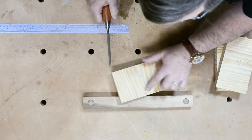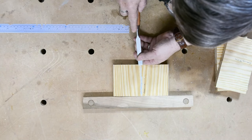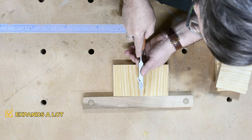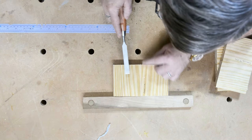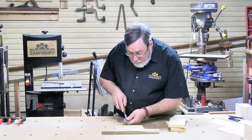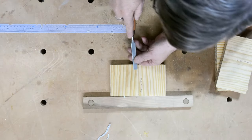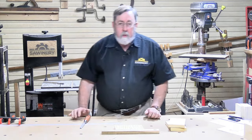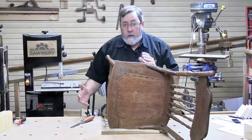Here's the Gorilla Polyurethane — you can see there's a lot of ooze-out, as we expected because Gorilla Glue expands a lot. And surprisingly, this cleans up extremely easily. My only previous experience cleaning it up was on stuff that had been glued and left sitting a long time before being turned over to me. So from a workability viewpoint, I'd say the Gorilla Polyurethane is an excellent choice — the easiest one to work with of the three, even though you get all that ooze-out.